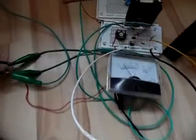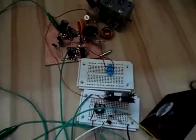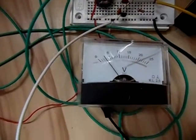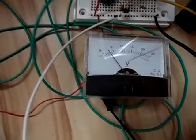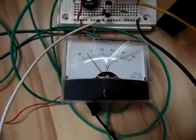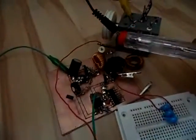Now I'll show you something about transmitting with high power. You know these Part 15 FCC 100 milliwatt transmitters. As I said, in this construction this thing is already putting out a quarter watt, because on the final amp I have around two volts at 120 milliamps, and if you calculate that you get around about 240 milliwatts - around about a quarter watt output.